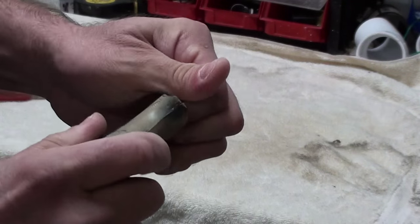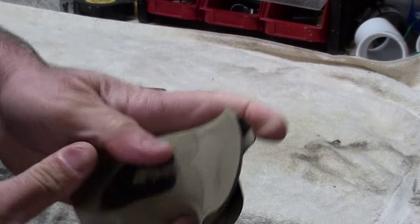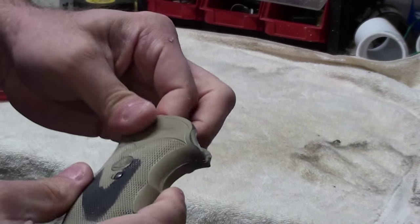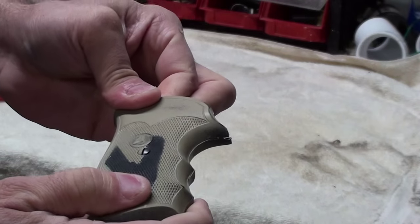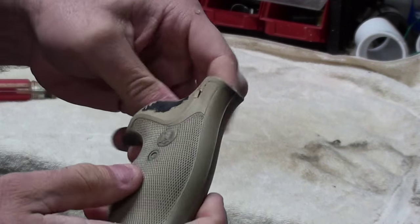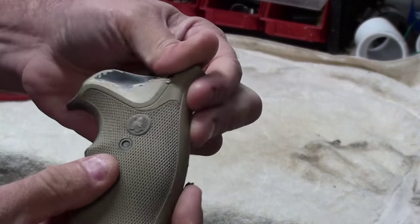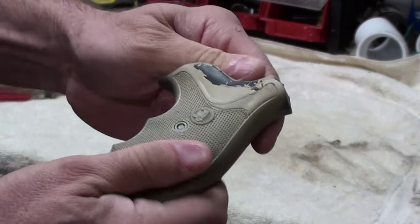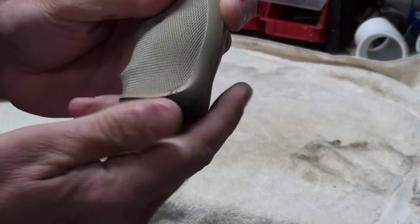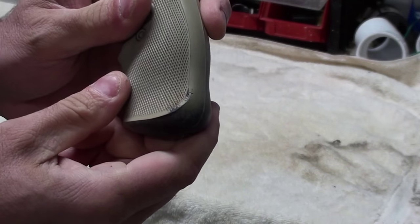So here's what you got. I'm rubbing pretty firmly. What I've done is I've actually vulcanized the vinyl paint right into the rubber itself, so it's bonded to the rubber. This side that wasn't heated is just blistering and cracking right off — there's nothing to support it. If you rub it enough, it just comes clean.